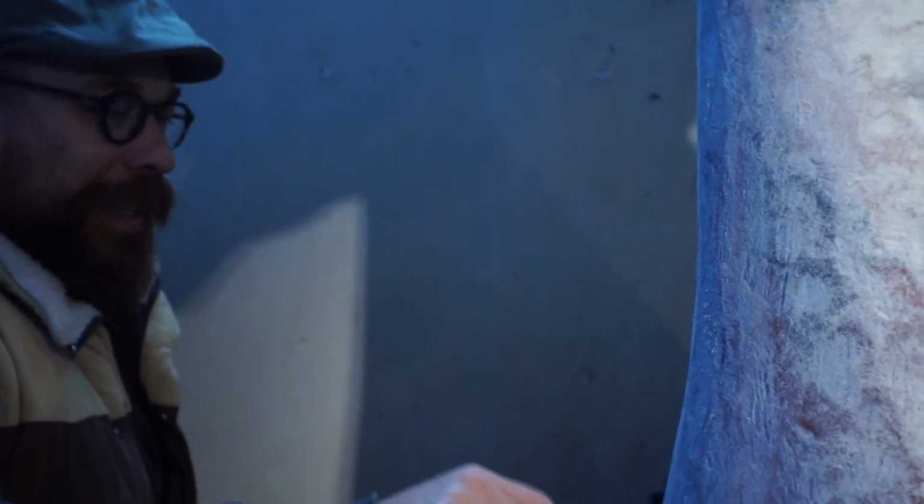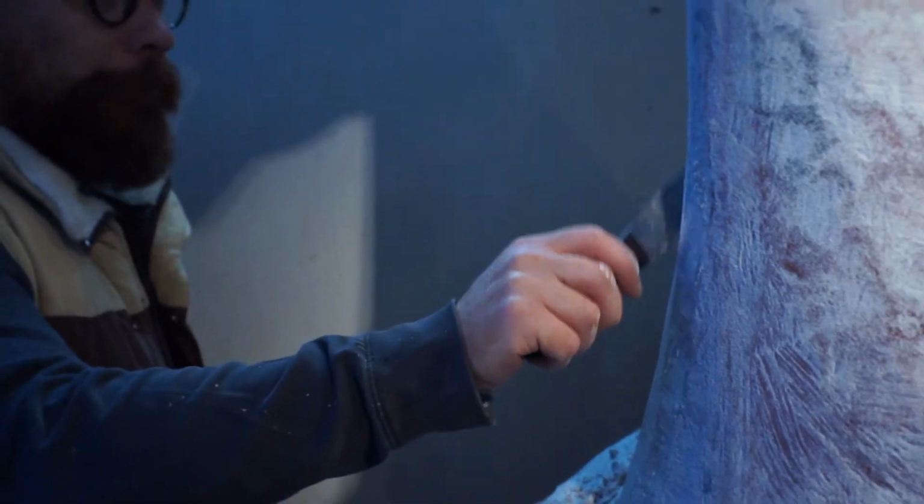The cement is then built up layer by layer. I try to work the whole thing in one coat, and then I work the whole thing again in another coat, and I go over and over in the same way that somebody would stucco a house. I was really looking to stucco as my workflow model. There's a scratch coat that you put on and you actually scratch, so that the next coat will bond with that scratch and link to it. I'm using an acrylic additive to my cement too, to make sure that everything's sticking really well together. It makes it more watertight and less likely to delaminate, to flake off.